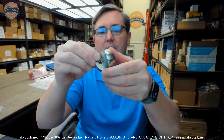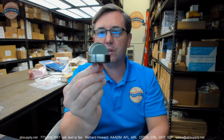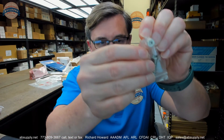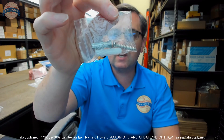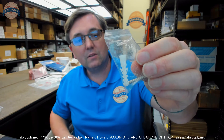At the end of the day, the fastener goes down into this hole. You're going to drill two holes, and this post just keeps it from rotating — that's all it does. It looks like it's about a number ten screw with a square drive. It comes with a lead anchor and a plastic anchor. If you're going into concrete, use the lead anchor; if you're going into wood, use the wood screw alone; if there's a tile condition, you might run the plastic anchor in there as well, maybe hitting a subfloor.